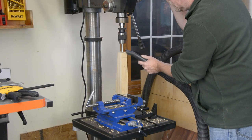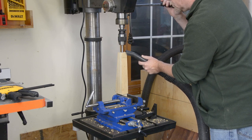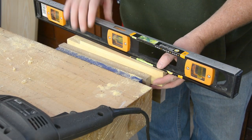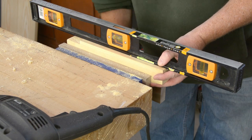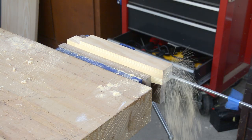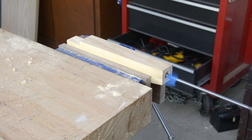The adjustable portion of this leg comes from a metal tube that slides in and out of the wooden leg. I drilled as far as I could on the drill press to get started perfectly straight, and then had to finish it up with a hand drill — so I leveled the piece in the vise and referenced the bubble level in the drill to make sure that this big long ugly spade bit kept going straight.